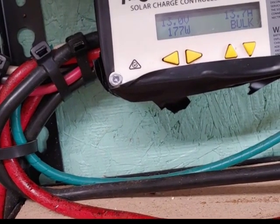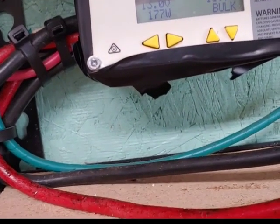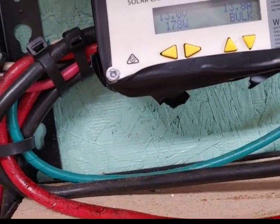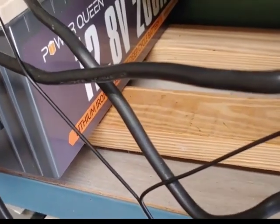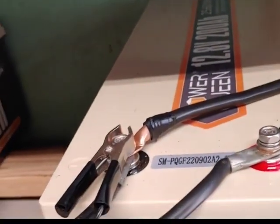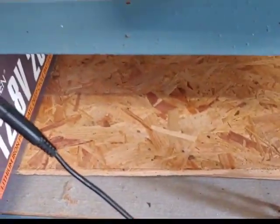These things go down. We're at 13 volts. As soon as the sun comes up, it will pull back up. My batteries, which are not perfect yet because I don't have all of them — I have three of these cheap Power Queen 12.8 volt, 200 amp hour batteries. I want four because I want to have enough storage power in case the power goes out for a while. We've had several power outages, so I'm glad I have these. One more will go there.